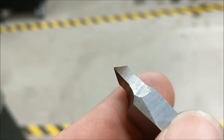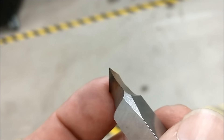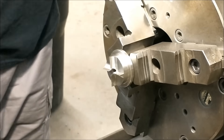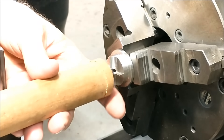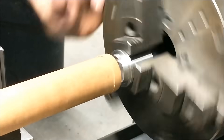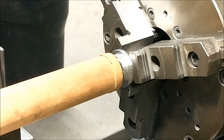The tool I'm going to use to test this little arbor is very hooked — it's high-speed steel and it is specifically for cutting wood. I found that if you can get under the grain and shear it like a knife, you're in good shape; too much surface contact just leads to a ratty finish. I think it will be clear to see how a point on this particular driver would benefit the installation of the part — if you've already laid out the center and pre-punched it, just line up the center before applying the pressure. I'm going to check my concentricity here in a second — it's running out a little bit, I'll make a slight adjustment. Watch the gap between the wood and the arbor disappear with the application of tailstock pressure — that is a solid bite.